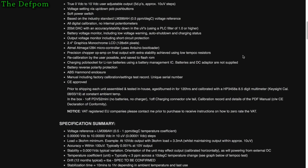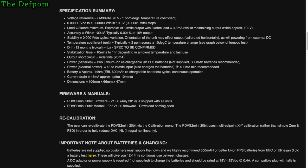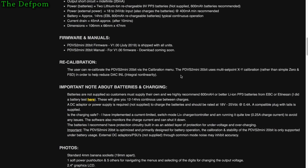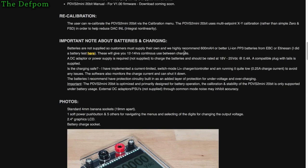Make sure you go and read the specs page properly. Minimum load is 3 kilohm — the testing I've been doing has been completely open circuit with no load. The 12 month typical drift spec is still in progress because it hasn't been around for 12 months yet. Stabilising time is around 10 minutes to an hour depending on your ambient environment. Battery run time is about 12 to 14 hours, which should be adequate for most things. Firmware updates will be available and you can recalibrate them. There's information about the batteries, charging, and various test photos showing the internal layout.